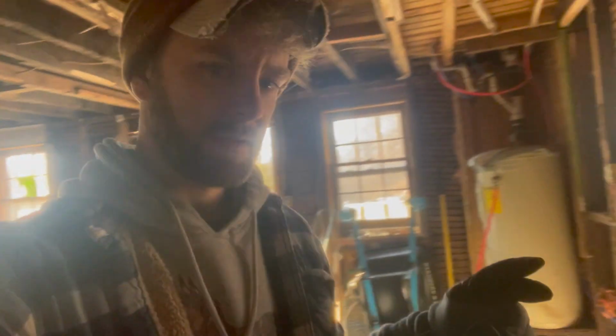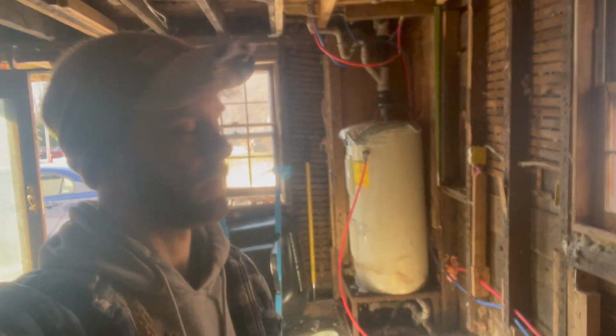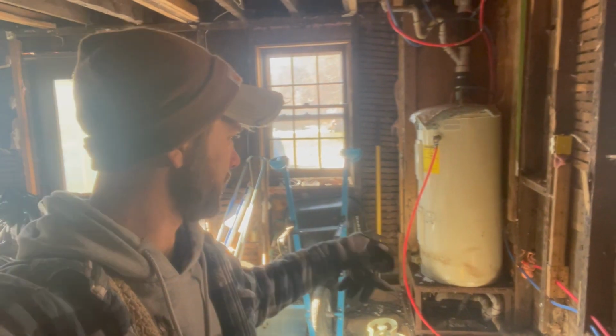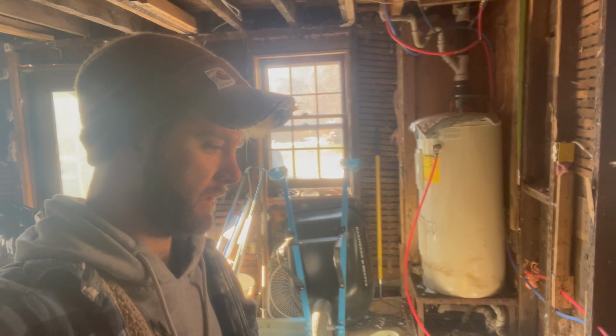The other major issue that I was looking at is the sill plate from basically where the beam comes down here over and through likely to the corner. So that means I gotta figure out if I gotta move this or take this out, what to do with that. I know I mentioned this before, but give me some ideas as far as how to remove a sill plate that's kind of in use. That span is probably 12 to 16 feet. That span over there on the other side is probably only 8 foot.